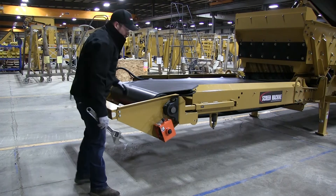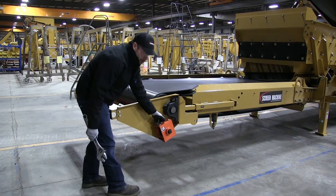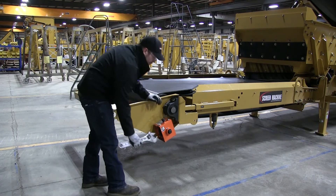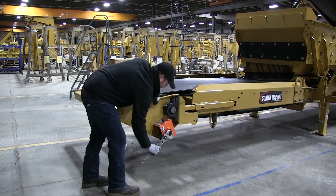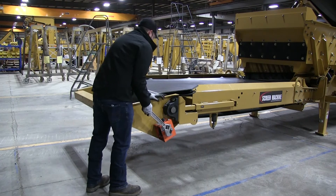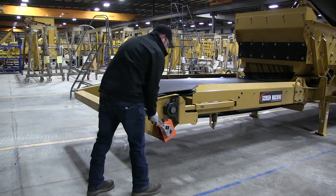In order to tension it back up, make sure that your ratchet lock here is oriented the same as before. There's two different ways you can do this — it'll either ratchet that way or ratchet that way. We want to ratchet up towards the belt. Take your adjustable wrench again, keep twisting it until it's up against the belt like that. Give it one final click for tension.